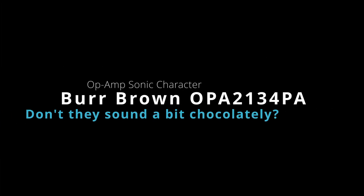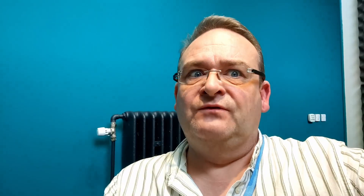That's more like it — plenty of detail. But is it missing something? Some of the warmth that the OPA2134s had? Maybe. So I swapped the output stage to those, and — that's it. I know some people think the Burr-Brown OPA2134s can be overly warm sounding, but I quite like them. I've got a soft spot for them and used them in several places before. The trick is not to use too many of them, but they are very warm and also very open and spacious for an op-amp — still one of the better ones, really.